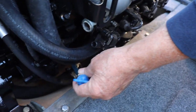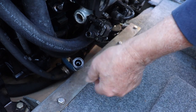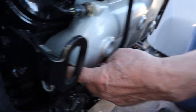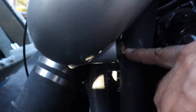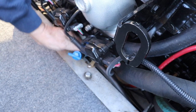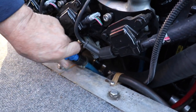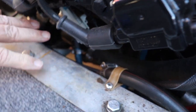Down here you'll find some blue hoses — there's one on each side. These are your drain hoses for the water. You want to drain every drain plug you can find on this engine. There are plugs for the exhaust manifold, including a brass plug, and all of these will drain the exhaust manifolds. On the other side it's the same thing — a blue hose with a little blue cap. Just remove that cap and push those hoses all the way back down into the bottom of the bilge so they drain out completely.